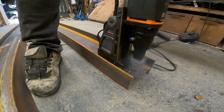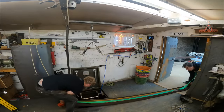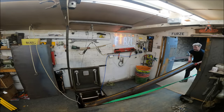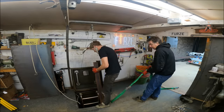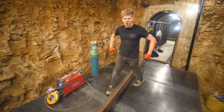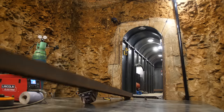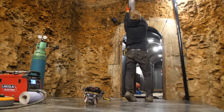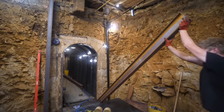To get these beams down into our underground garage, I developed a lovely system of strap and lower. Basically we attach the strap to the end of the beam and then lower it down, and with a little bit of manoeuvring we can lower it down quite safely. I then welded some flat plates onto the end of the beams to spread the load from when they've got all the weight of everything above them bearing down onto the rock. They'll be bedded in concrete of course, but it's still good practice.